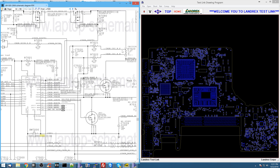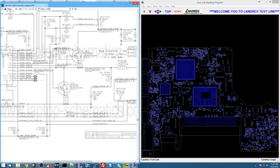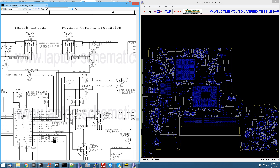The charger power, before going through the rest of the computer, goes through this resistor. There is a very small voltage drop across the resistor, and the U7000 is going to measure that voltage drop at the top and the bottom. Once it does that calculation, it's going to have an idea of how much current the system is using. Same thing is true for the battery — we have a battery current sensing resistor here. Before the battery comes into the computer, it goes through this current sensing resistor, and the U7000 chip will determine how much current the system is using.